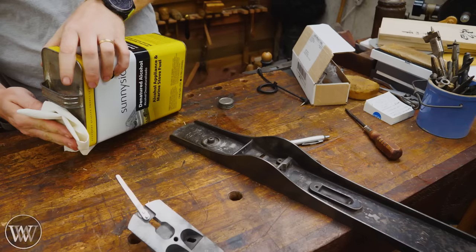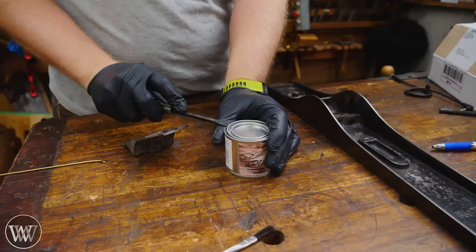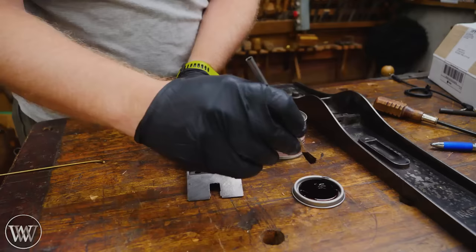The paint actually comes off with this. But with the small compressor and using a softer bit, it just won't get into the Japanning that much. You can still see there's probably about 70 to 80% of the Japanning on there. But because we sandblasted, it kind of smoothed out the edges and I can bring in new Japanning.